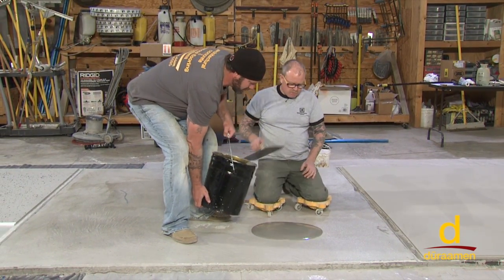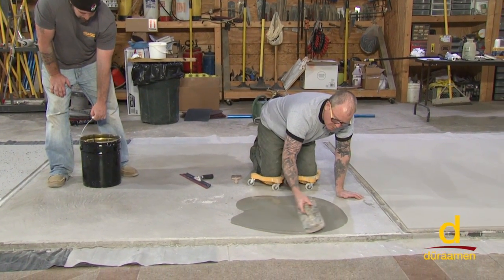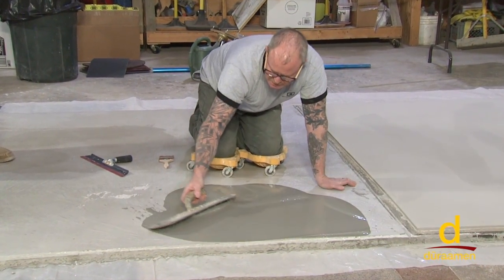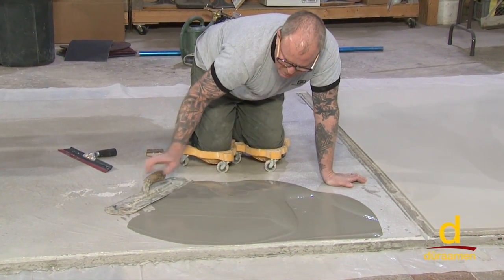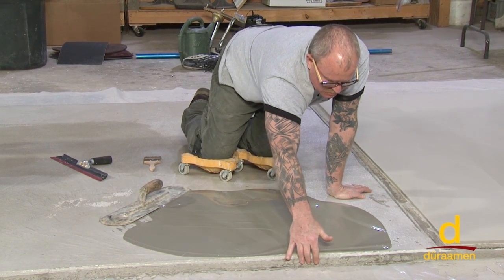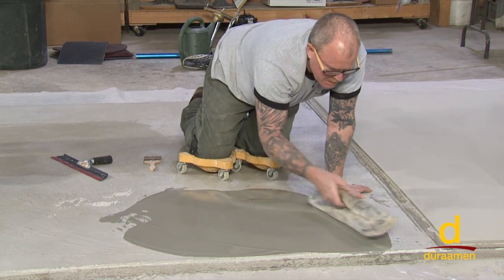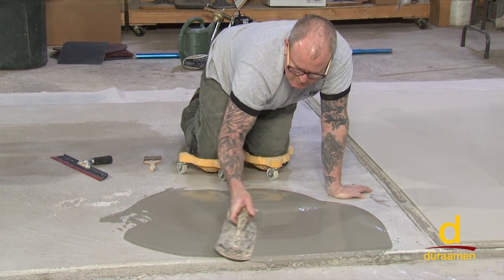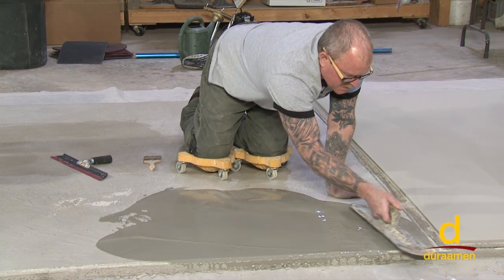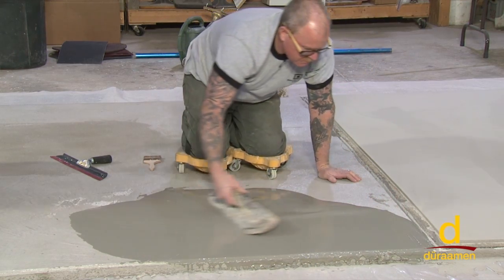That'll do. So when you're putting this material down, remember this can be used both inside or out. So it's an exterior or an interior product. Say, for example, this was a patio or a driveway or a walkway. One of the things that does not look good is to not treat the edge of the material, or the side of the concrete, the existing concrete. So what I like to do is just go ahead and let it run right over the side, like that. So at a minimum, it's the same color. And Brian, if you wouldn't mind just taking a brush and brushing that edge.